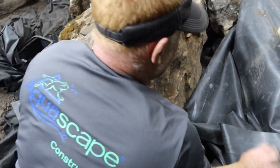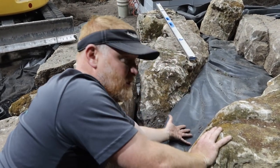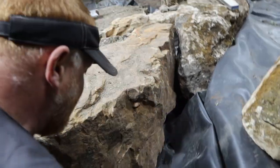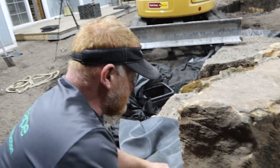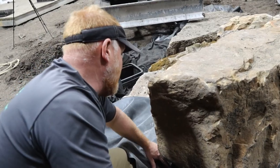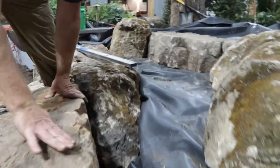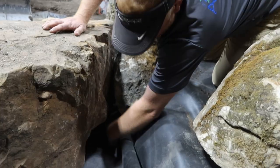As that happens I haven't created a place for water to escape. Even though I'm going to foam a big rock in here to keep that water pushed that way, water is still going to migrate a little bit underneath that foam no matter how good of a job I do. As that water comes down through here it needs another place to escape. You could easily just come like this, put a gravel vein here - sometimes we even do a little pipe and run a pipe around here and go that way. But what I did before we set this rock - I dug a trench before I put the liner down.